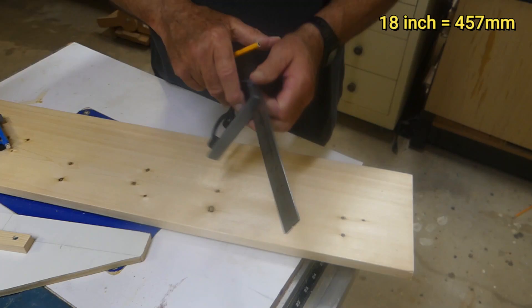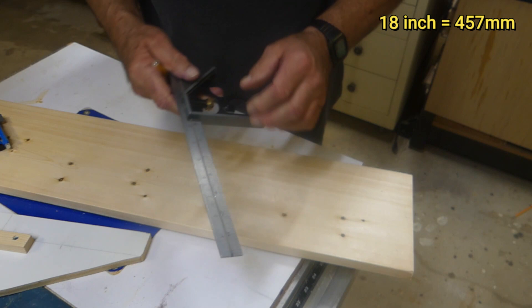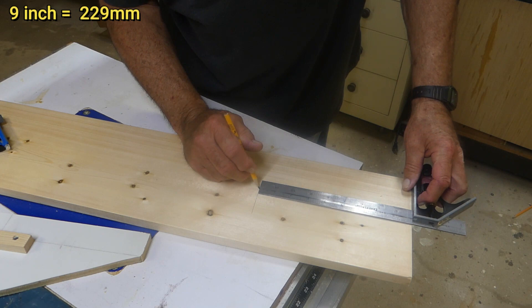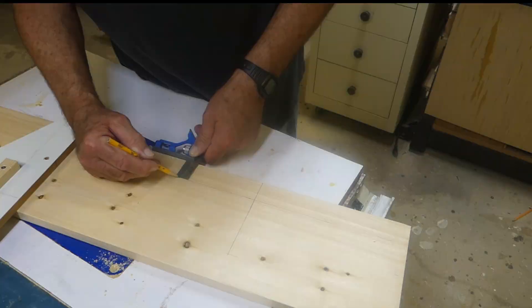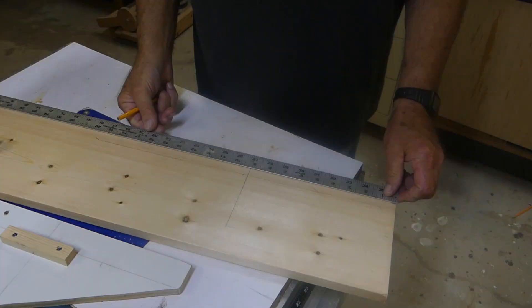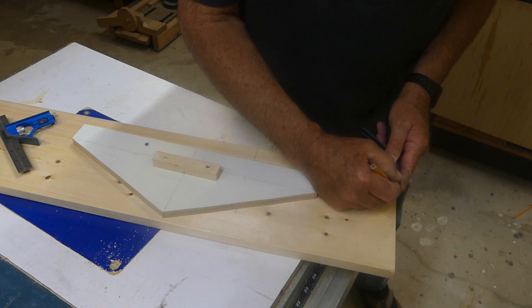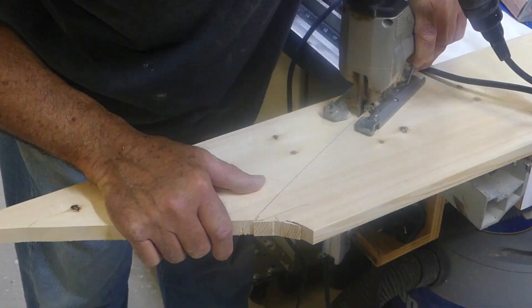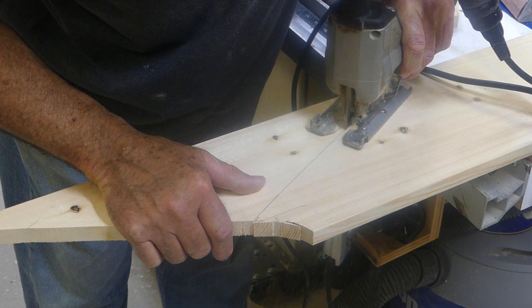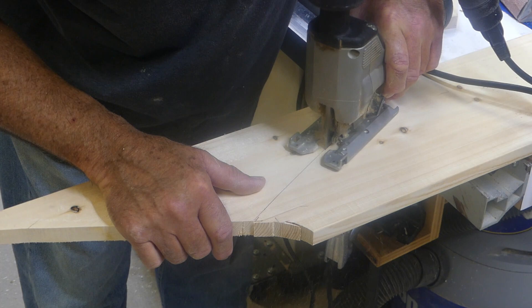I've cut a square edge and we're making the new ones 18 inches long. I set my square at nine inches to draw the center line, then at five and a half inches for the height. Draw one inch from the bottom for the center positioning block. I marked the length at 18 inches and measured up one inch on each end where the slope terminates. Using a yardstick I draw the slope on both sides from the apex at five and a half inches down to the one-inch mark on each side. I used my saber saw, just touching the line, then sanded down to the line and used this gable as a pattern for the second one.